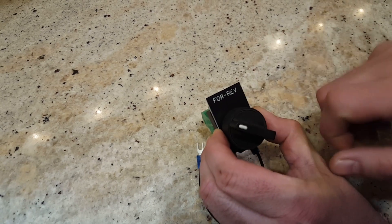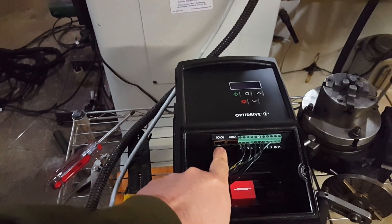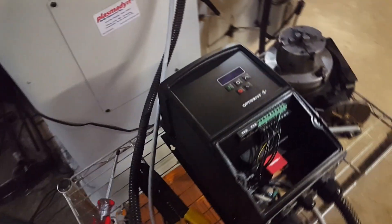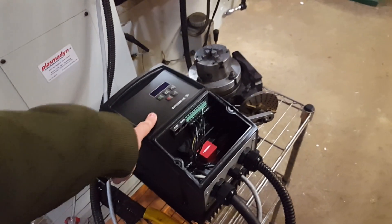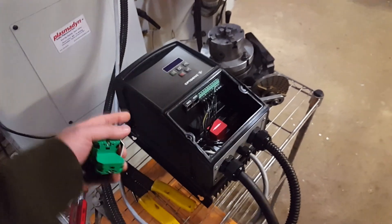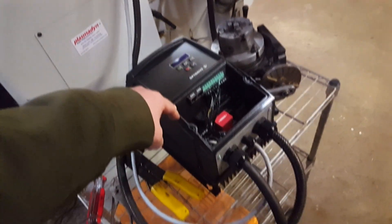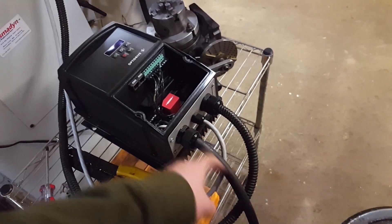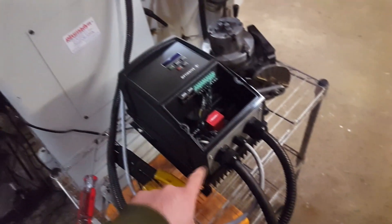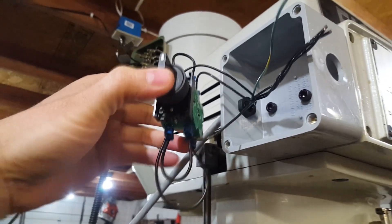So that's how you wire the forward/off/reverse switch and mount it on your mill. On the VFD: the motor wires go here, power from the wall comes in here, these are all the signal ins and outs, and there's a port to plug in a Bluetooth control if you want to control it with your phone. I always tell people never run one of these without a fuse set — that's your insurance policy to keep the drive from burning up if you short something. I'll install fuses in the future; basically you cut the line into a single-gang box and fuse L1 and L2, with ground passing through.